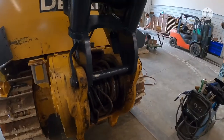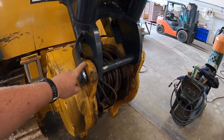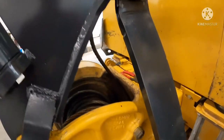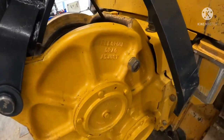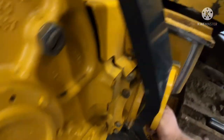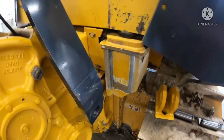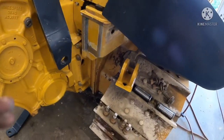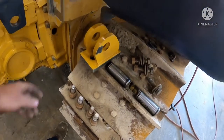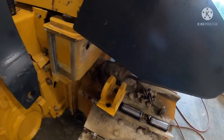But anyway, these log archers utilize this top mount on these 4000 series winches, and then they have a set of arms that come down that go to each side. And we've got this all prepped and everything. We're actually going to weld these on here. They go on sort of like that, and we'll weld those on there. I guess you could bolt those. They offer the same mount I think they use on the G series tractors that can bolt on the back of those. We feel like the weld's a little stronger, it spans that out a little better.